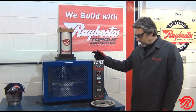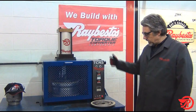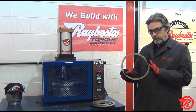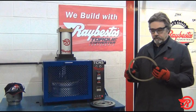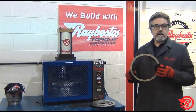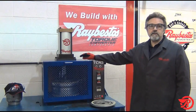While we're doing that, we want to make sure we've got the right amount of air pressure on our ram, which we determine by going through our formulas. We've already measured this ring — the outside diameter is 9.875 inches and the inside diameter is 8.75 inches. With those calculations, we were able to determine that we need 120 PSI on our 6-inch ram to do the bonding needed in order to get the proper amount of net facing pressure.